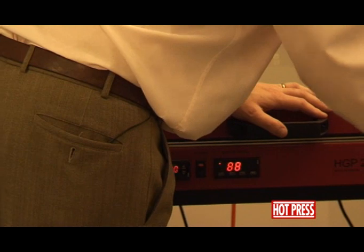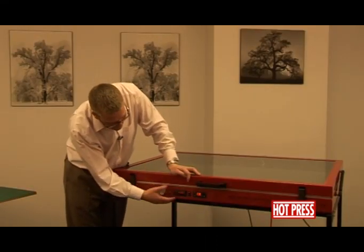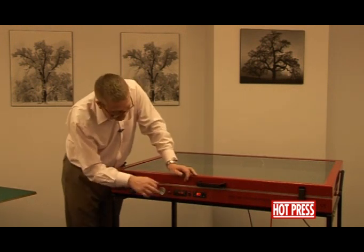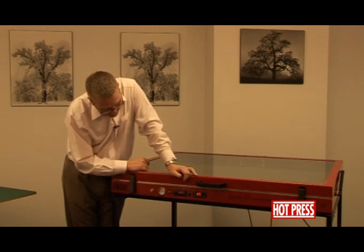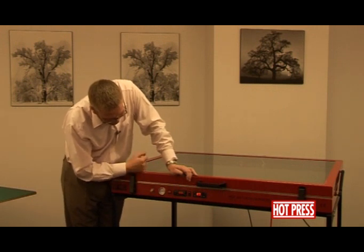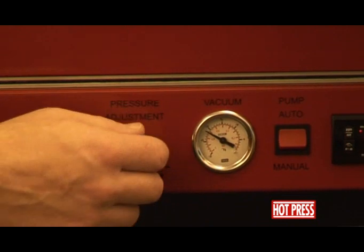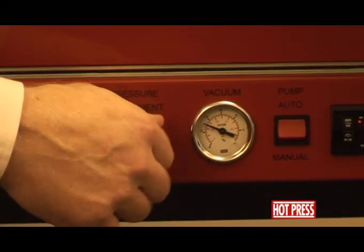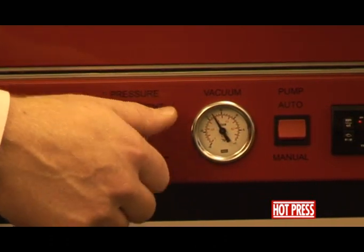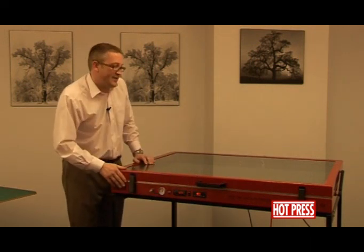Close down and put the latches on. Switch the pump on and press the start button. We've got it set at four minutes and twenty seconds — the twenty seconds is to allow for the cycle to work, and four minutes because the thickness of the four layers of foam will absorb some of the heat. We're also going to back off the pressure using the pressure adjustment gauge — winding that out to about half way, reading roughly one o'clock on the dial. So we'll just wait for that to process.